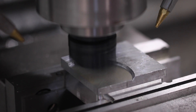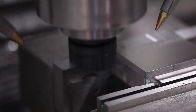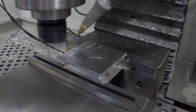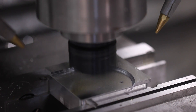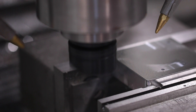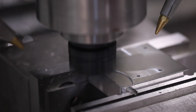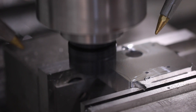Eats it right up — this Superfly is incredible. There is a major downside to this tool: you will hurt yourself if you don't have the enclosure. Another 100 thou and that will leave us about 30 for a cleanup. You can't use a Superfly because of the wide radius swing and the interrupted cut if there's a big flap you're going to expose — it will pull that flap up. We don't have that here. G01, Z0, F10 — just come down nice and slow. Escape key turns you off, I forget that on PathPilot. Let's take another 4-5 thou off and get that flashing on the edges. Clean up.